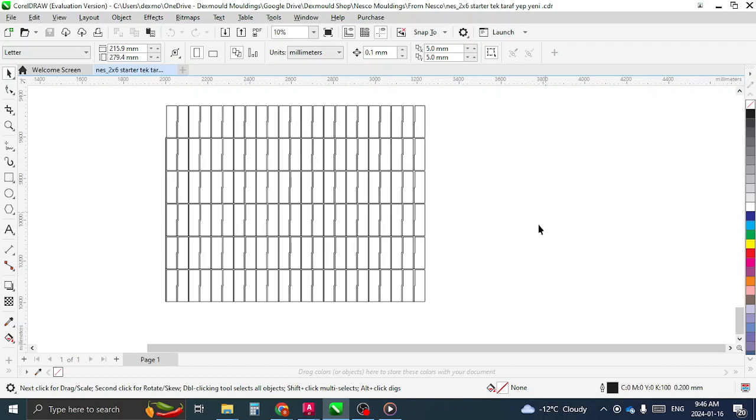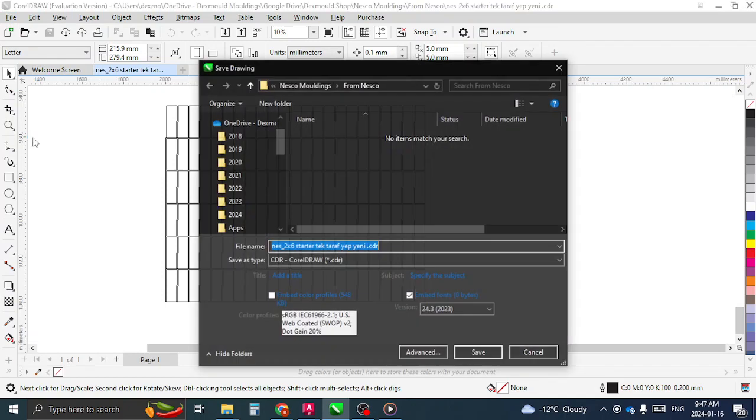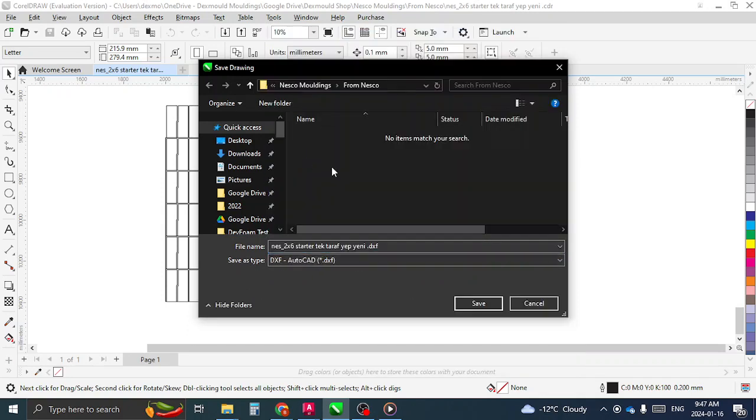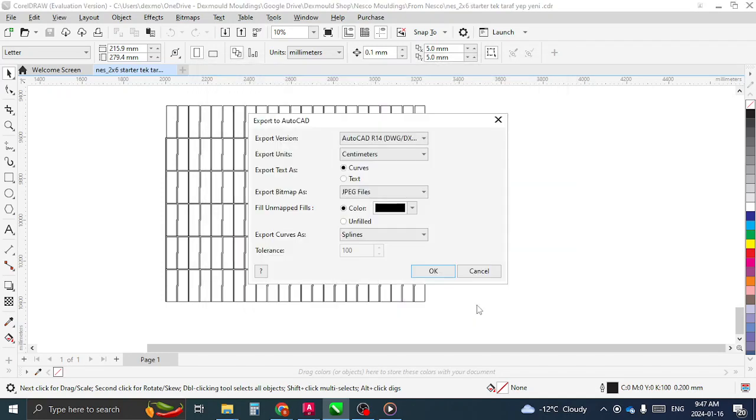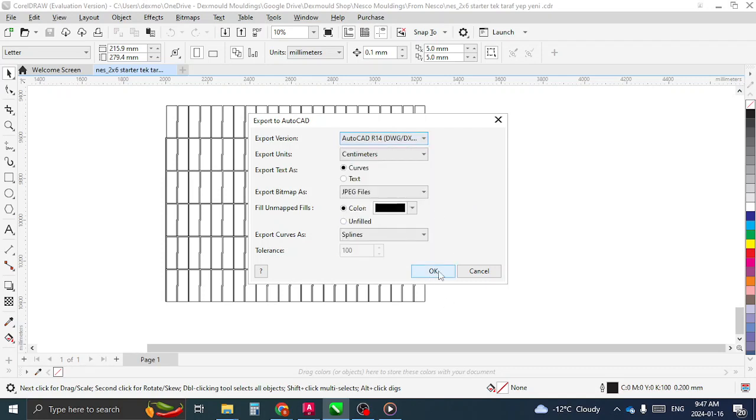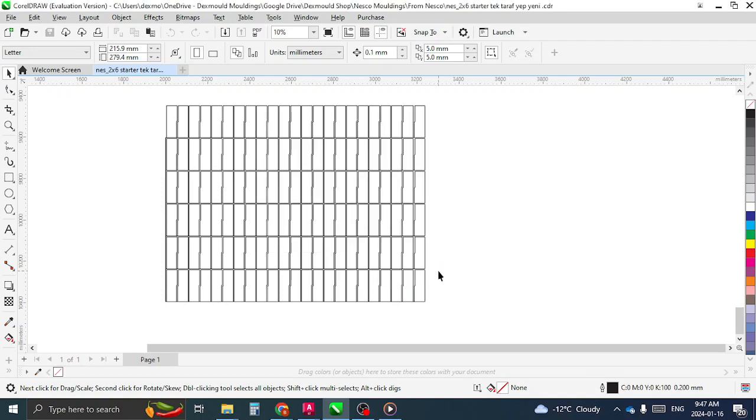And then, okay, so say you guys wanted to cut this out. This would be your file that you guys would already have. You just need to save it as a DXF, which is pretty straightforward. You'd only have to do this once, I think, if you wanted to reuse the file many times. Saving it in the same folder just so I know where to find it. And then the only thing you have to do is click save it as R14. It just makes the CAM program and the next program a little bit easier to work with. Okay, so I saved that as a DXF,